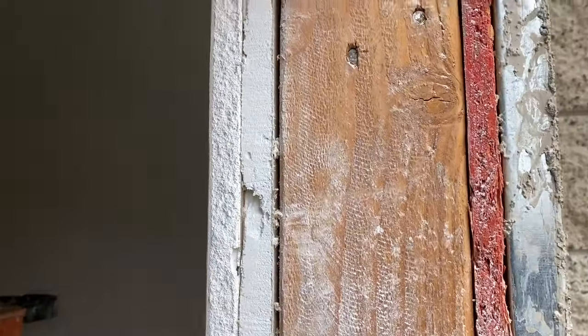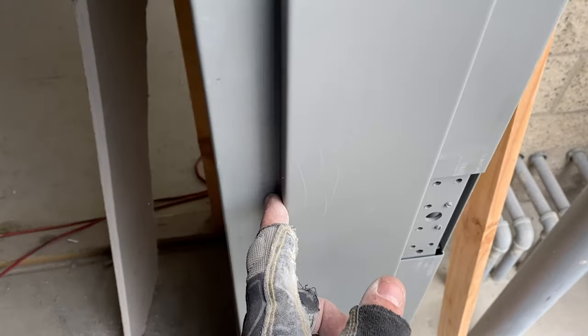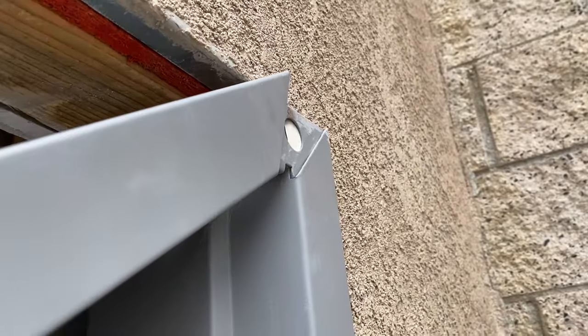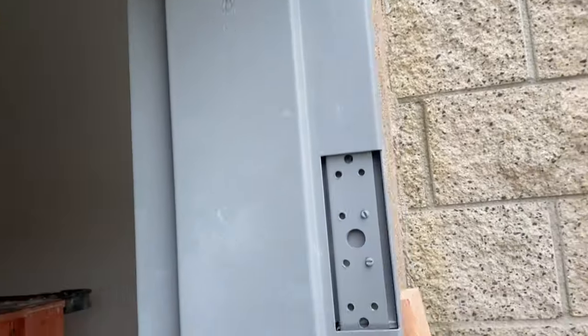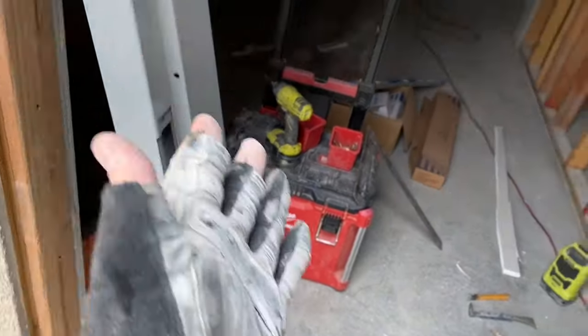I'm doing a dry fit first, so I just pop that one in and put this leg in just to test the thickness. On the outside of this jamb where the door is, it's wider, so when you put your top jamb in it's got to go the same way. Line it up like this — you hold it on an angle and you see how it has to slide underneath those tabs on both sides. Once it's in there it snaps up into place. Then I just throw it up there and make sure everything's going to fit, so I have plenty of room to get my other jamb leg in. With all that in place — remember nothing's been attached yet, we're just dry fitting — I take this jamb leg and put it on an angle.